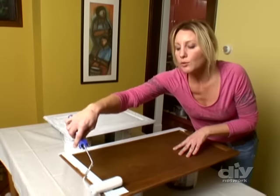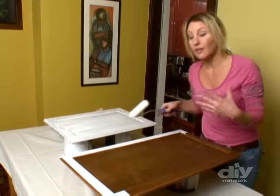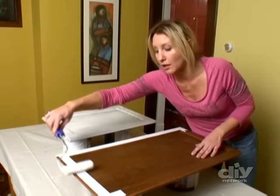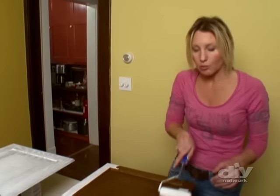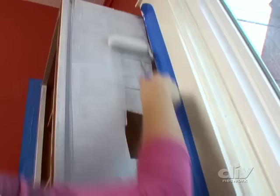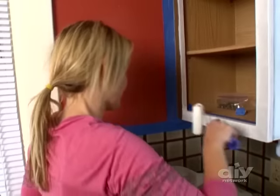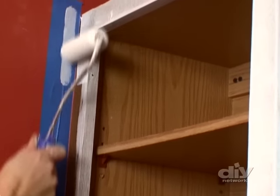If you're repainting cabinets that are already painted, you can probably skip the primer unless you're changing color — going from red to white, for example, you'll want to prime. If you've sanded all the way down to bare wood, you'll want to prime as well. If you're painting the cabinets a color, ask to have your primer tinted the same color. Don't forget to check the drying time on the can — if it's very humid or very cold, it will take a little longer to dry.